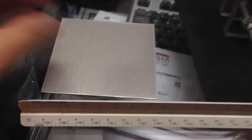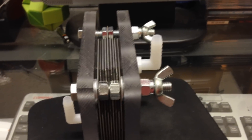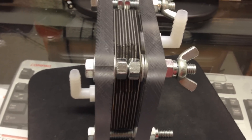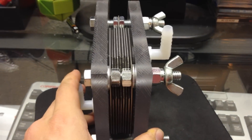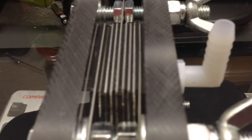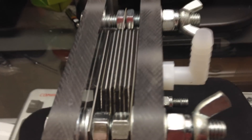Because my original design did not work well. I originally designed it to have a negative and a positive plate with 6 neutrals in the middle. I hooked it up to test it and it almost did nothing — it was hardly making any hydrogen at all. The voltage was just too low, even with a really powerful mix of electrolyte. The first time I just used baking soda, but when running it I'm going to use sodium hydroxide — and that's what I tested it with today.